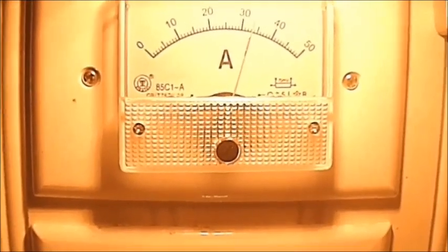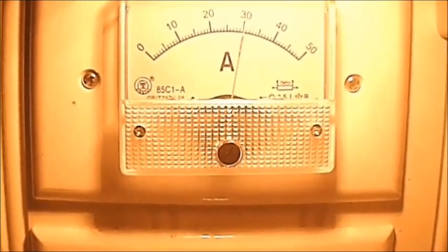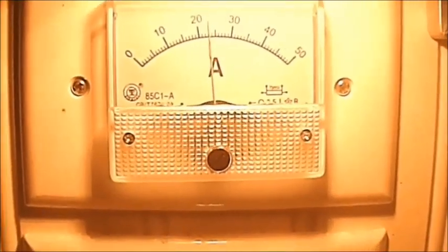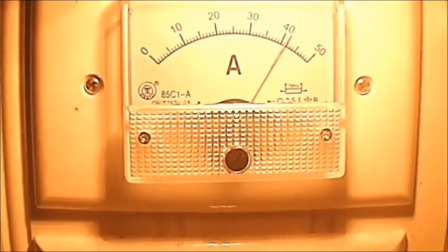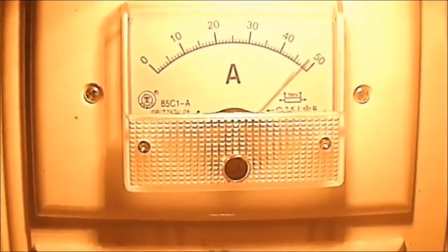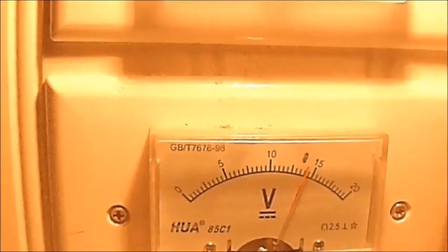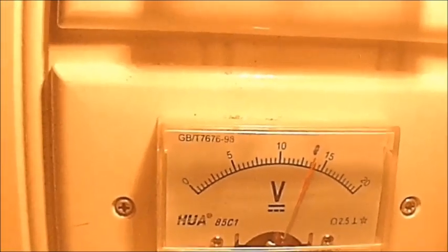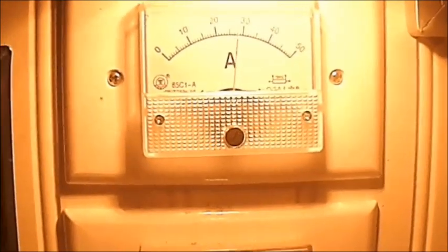We've been having an inversion — that's when you get a swap around of pressure zones and all that jazz up here in the mountain ranges. This one here, there's 42, 45 amps — there you go, peek out. That's what I'm talking about. The voltage is slamming pretty high; it's been peaking upwards of 16, 17 volts when it does that. It's been making some real good power.